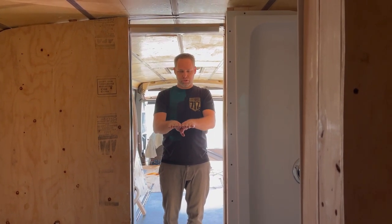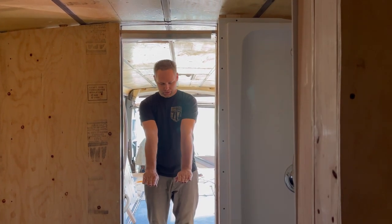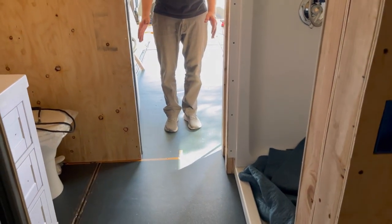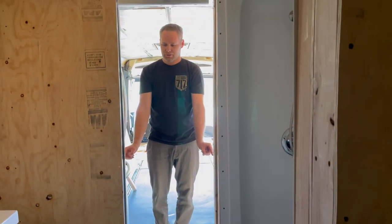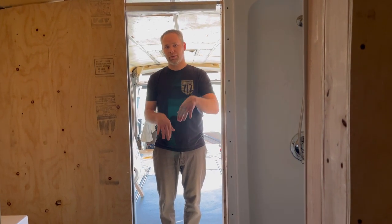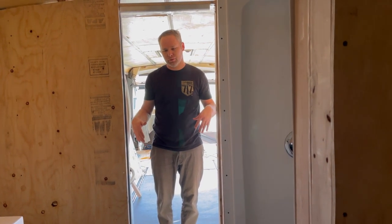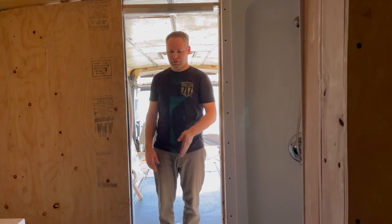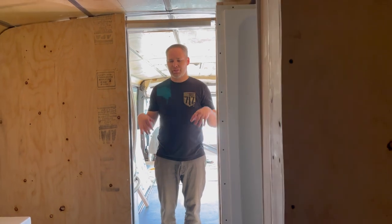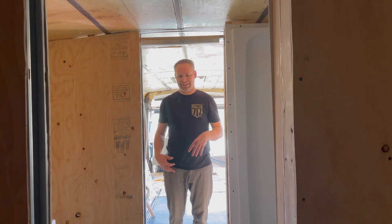we've just, in playing with it, basically found that two panels in the middle gives us just enough on each side to where there's not just an inch, because you don't want it to be too skinny. You can't do a long run with the floor. It won't lock if it's not wide enough. So it's okay on a far edge, but something in the middle where there's a lot of wear and tear, you're going to have a lot of traffic. There's going to be movement. The floor will move, but you don't want to have something super skinny.